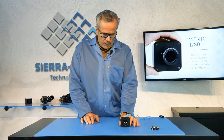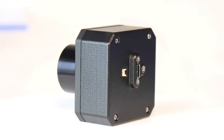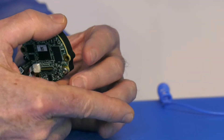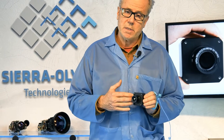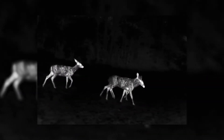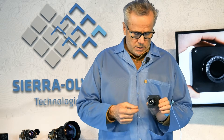It's a very small camera. It includes a USB digital video output. The focal plane is new, completely unique — 1280 by 1024, 10 microns — offered by no one else. The sensor operates at 30 hertz and can support an external synchronization source. The sensor delivers a 50 millikelvin NETD and offers four times the resolution of common VGA resolution, or 640 by 480 or 640 by 512 sensors.